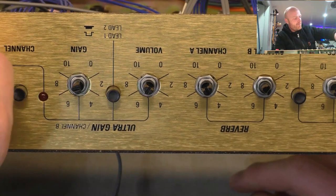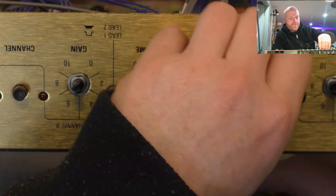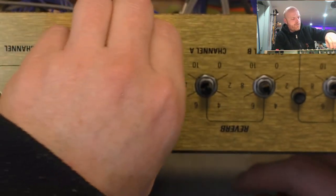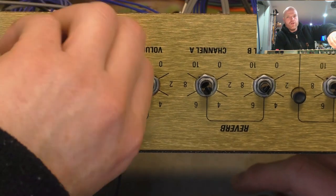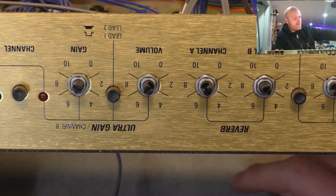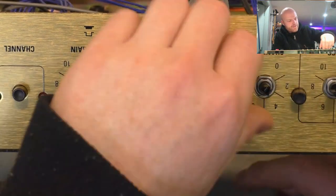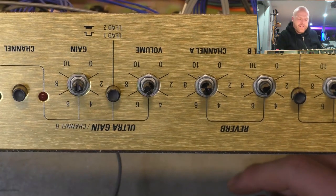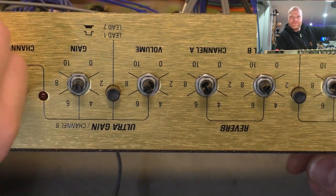A lot of amps that people have been to before me, the pots are all cross-threaded because of these weird square bushings on them, and they've destroyed them. The pot's fine, but they've either stripped the thread or ripped the bushing off it or stripped the nut or it's jammed on there. So if you know what you're looking at and you know how to deal with it, it's fine. But a lot of guys, it's just a nut and they thread it on and it gets stiff. So what do they do? They just tighten it up. Nothing tighter than stripped, am I right?